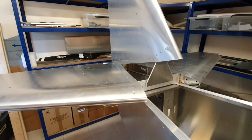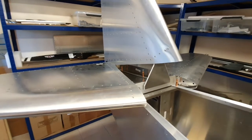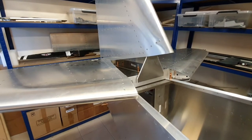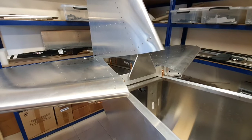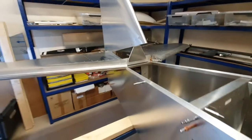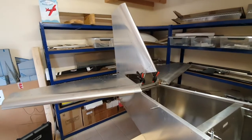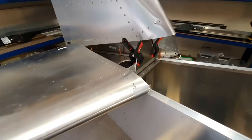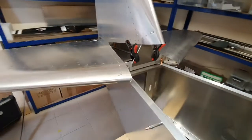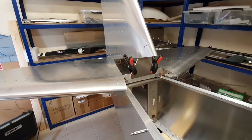It says there should be between half a millimeter and one and a half millimeters of gap between the tail cone and the horizontal stabilizer skin, so I'm going for about a millimeter as a halfway point. Update: what a tricky job that was - it took two and a half hours to trim the horizontal stabilizer skins to the point where I could move it forwards into position and have it square with the aircraft. Using a file was the only way to do it really.